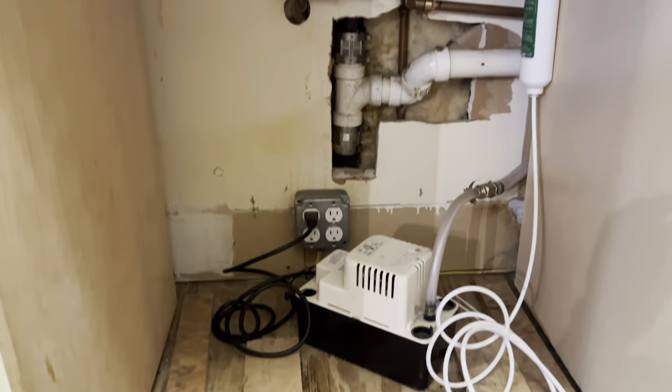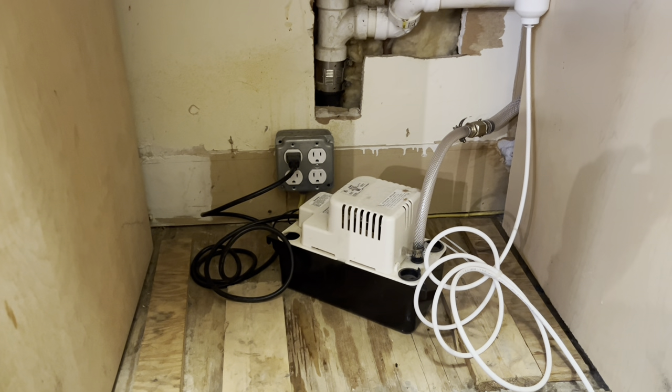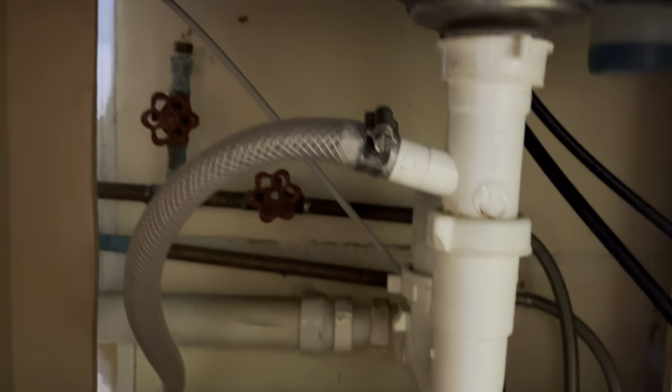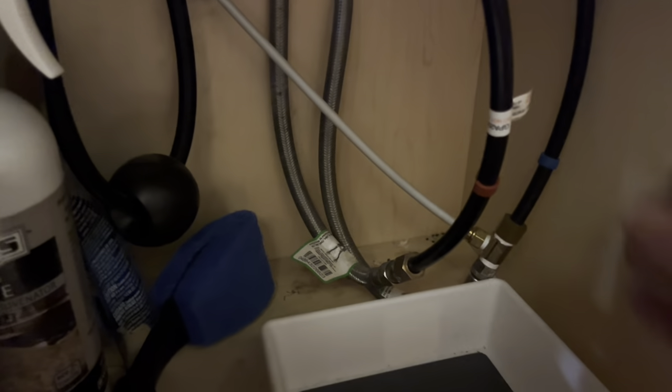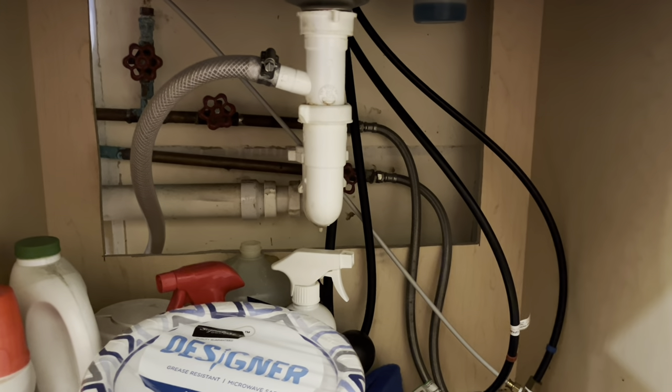That is how mine is set up, and I'll show you that tap over to the sink if you're doing this yourself. You can see right there that is where I've attached the drain line from that condensate pump, and I tapped into my cold water supply — which I have off right now — in order to feed the ice maker.